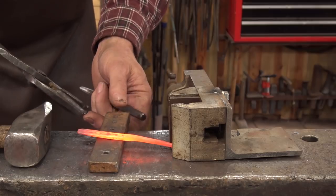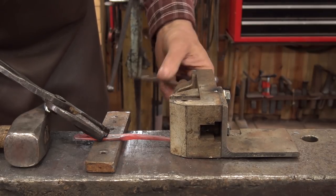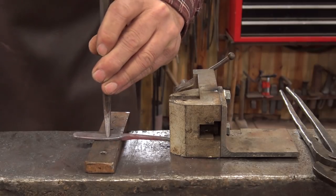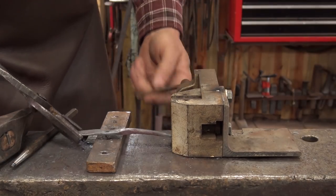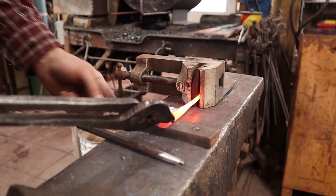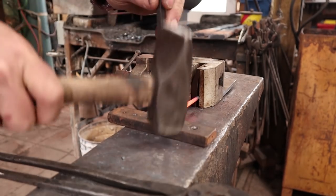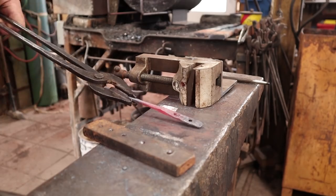The next thing I want to do is go ahead and punch those holes. I don't think I've shown this little clamp in very many videos — just a drill press vise somebody sent me with a tab welded on it so it goes in the hardy hole. I think the second hole may be faster now that I've got that set, but it does help hold things so I don't have to chase it. Pretty nice idea. I'll link to the video where I first received this vise so you can see what it is and give proper credit to who made it. It is nice to have things held so they don't bounce around. So there we have our holes punched.